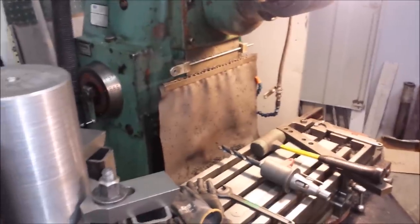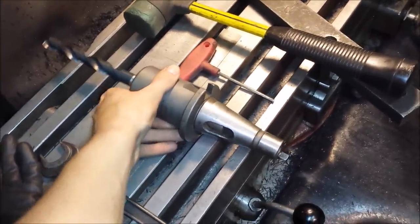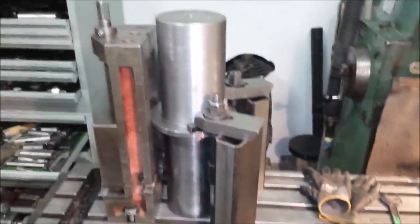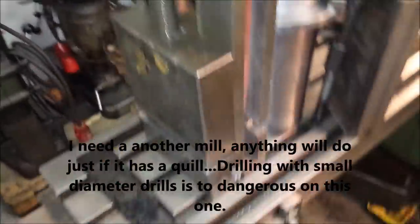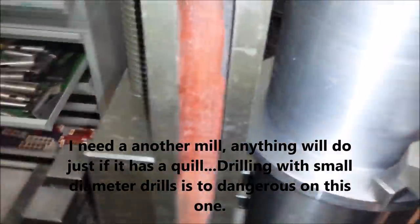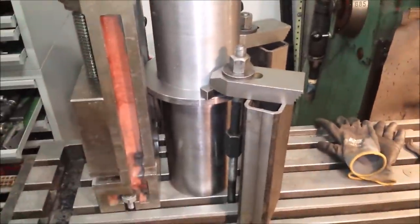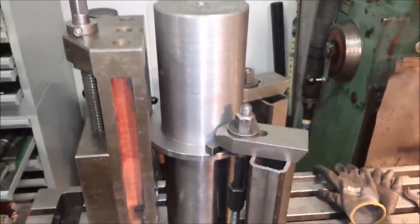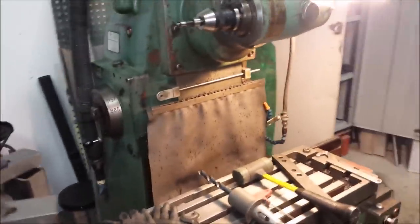I got this universal milling machine, and I didn't get enough height when I laid the axle down on V-blocks, because I want to use the Morse taper type drills and all the adapters to ISO 40 and so on, it builds and builds, so I couldn't reach it. And I don't want to put it in the drill press, so I had to stand it up. So this is the setup, and then I took an old vise and clamped that down just to support the force when pushing it, so it won't tip. This is a pretty sturdy setup, but of course I would have liked more to lay it down flat on the table, but you can't always get that because you haven't got a big enough mill.